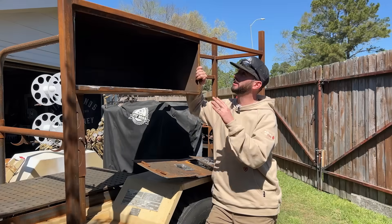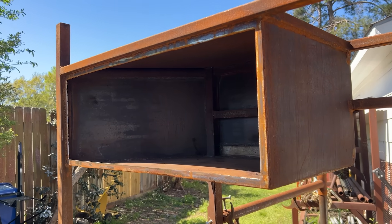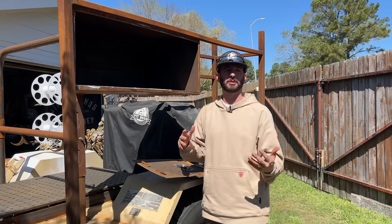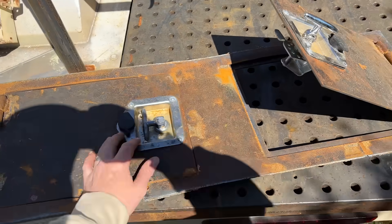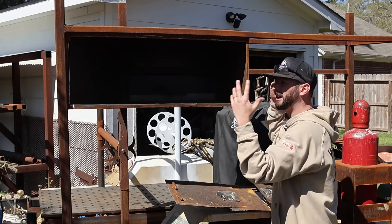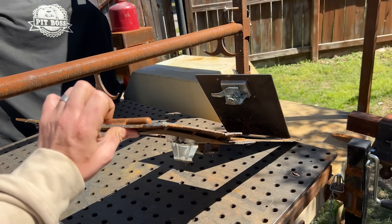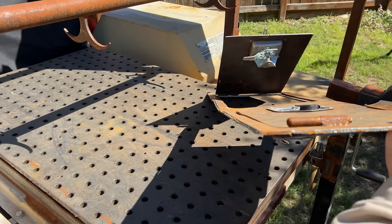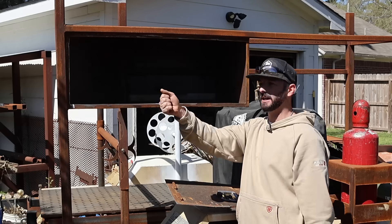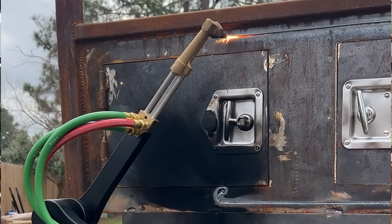I built this box here just the absolute wrong way - 100% should not have built it this way. I put in cheap metal pieces on each side and just kind of welded it in. It's all just scabbed together very poorly, including the door. I had two openings already on it, and then I welded everything solid. We got some distortion. So when I tried to put the actual doors in with the new hinges and handles, nothing lined up. Even if I locked the latches, you could still get them open. Ultimately, I hated it, so I took the gas ax to it and got it out.